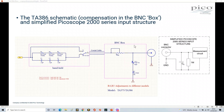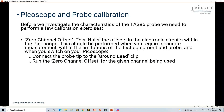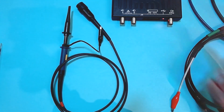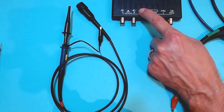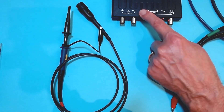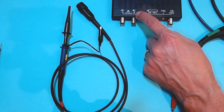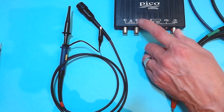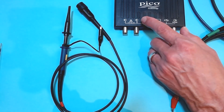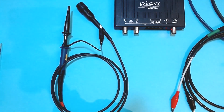Let's look at what the calibration process is. We need to perform a couple of calibration exercises, and the first one is we're going to zero the channel offset. Inside the PicoScope there are all sorts of buffer circuits and amplifiers, and they will naturally have offsets. What we're trying to do is get rid of all those offsets from an electrical perspective. This should be done on a daily basis because it may vary with temperature and over time in general. So we're going to zero the channels first before performing the calibration of the probe to the PicoScope.